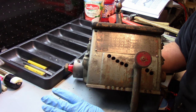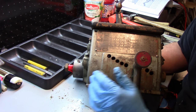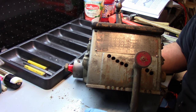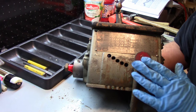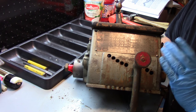The only lathe that has a wide range gearbox has something like 72 threads. I think the only lathe that has that is a 10L and the heavy 10. And I'm almost positive that was an option. I don't even think the 16 inches have that. I could be wrong, but this one obviously is just the same feeds and thread capability of the regular dual tumbler.